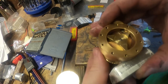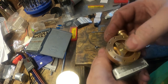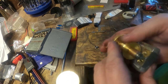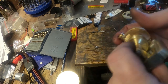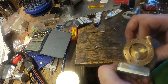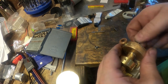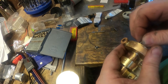So that's what we got. I think that'll do. A bit more curve in here, a bit more gap in the cavity here wouldn't have hurt, but it's not bad. I think it'll work fine. I've got a brass pulley that I made up quick and easy. And we've made up a collar there. And we can put some holes in, we can put some screws in the lid. Still need to make a gasket and put some paint on it. Give it a bit of a clean up.